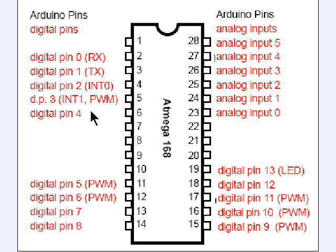I have a tutorial on my website on that. These are quite valuable because with an interrupt, when you change an electrical signal on an interrupt pin, the processor will stop what it's doing, go run a routine that you program into the controller, then it will come back where it stopped and continue on. This is like a keyboard on your PC. You press a key, it creates an electrical interrupt to the microprocessor telling it, hey, I pressed the key. This has lots of uses.